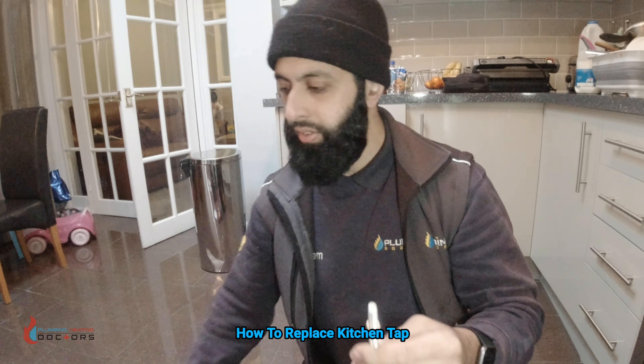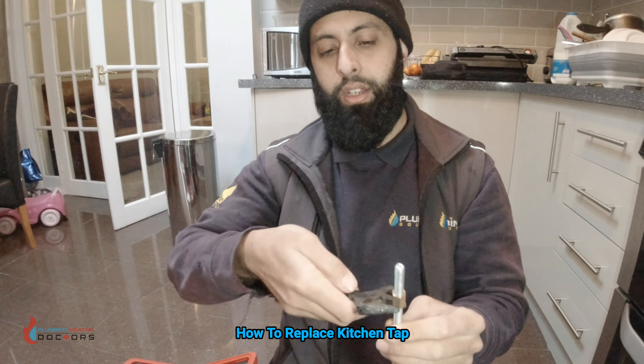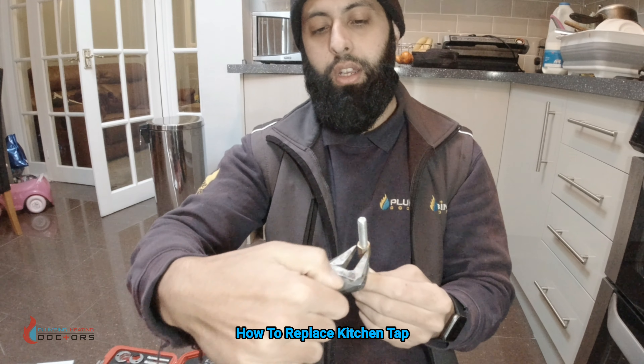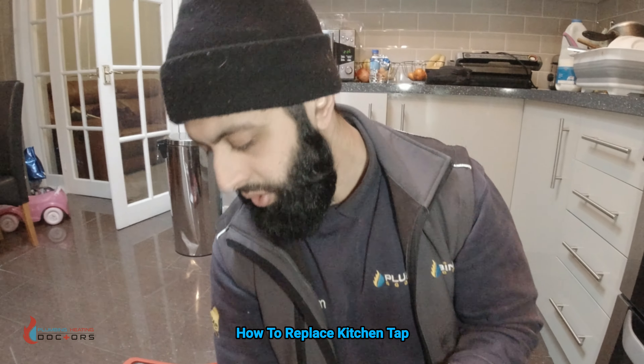He's taken the thread off the actual tap. Now you're not always going to be that lucky — you're usually not. So the other methods are getting a spanner on this little nut here and undoing it. Just be patient and just taking it off, and eventually using your finger — or sometimes the space is more restricted so you've got to get these tap keys.